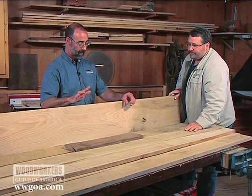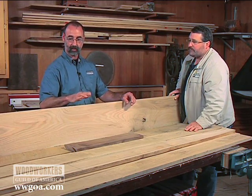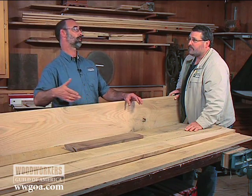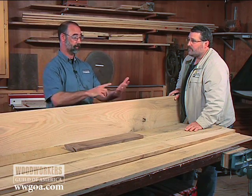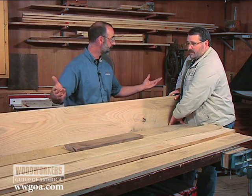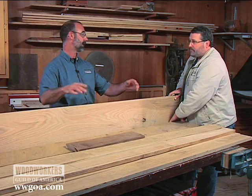Yep. So S2S is different from hit or miss. And with S2S, you're going to ask them, S2S to what? So you're going to ask the buyer to specify S2S to 13/16, 25/32, half inch, whatever they need. You can take it down to whatever they want.